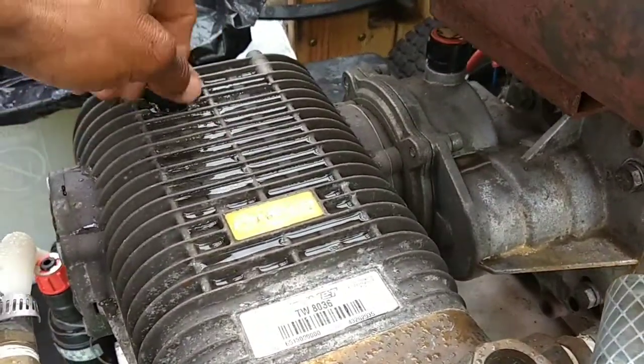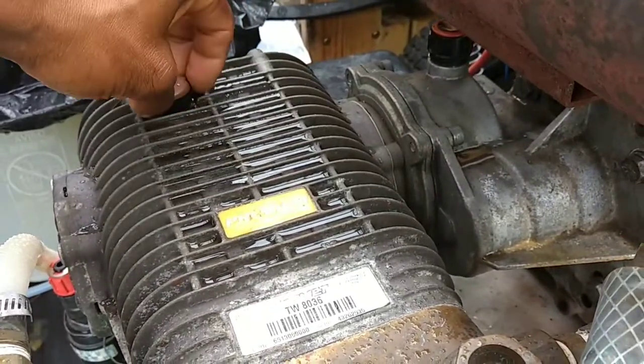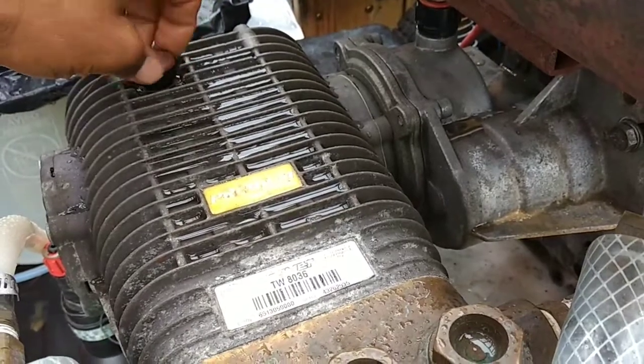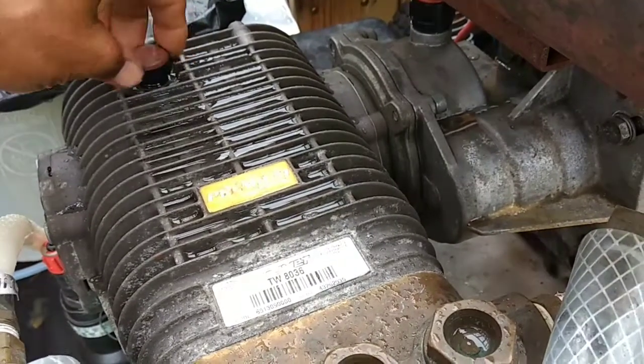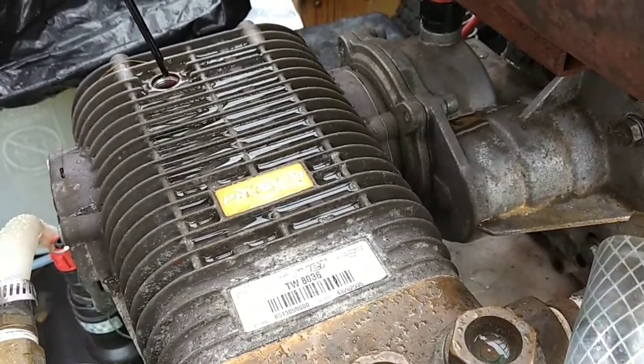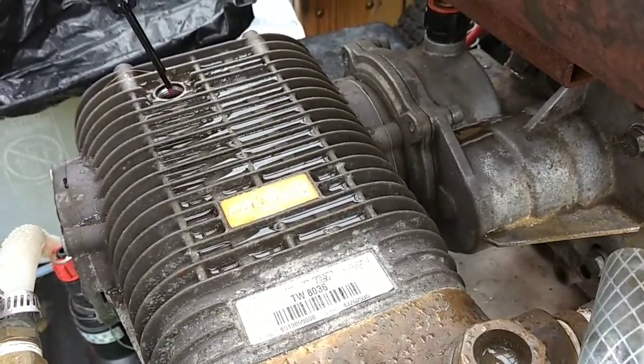At this service cap or level dipstick on the Comet pump — it doesn't have an o-ring — but I've never experienced this before. We did have some torrential rain last night, and as you can see, the oil level is higher than it's supposed to be.